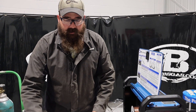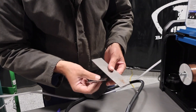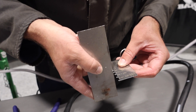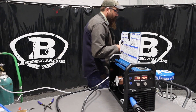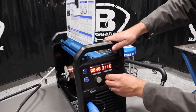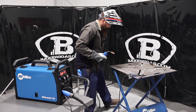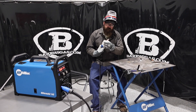Before welding I want to show you the material gauge. I've got a little piece of metal here — let's see what size it is. It doesn't fit in 14 gauge, so we're going to call it eighth inch. We'll set up our auto set to eighth inch on .030 wire and give it a try. So my setup is auto set, .030, eighth inch material. I've got my wire clipped, got my ground cable on — let's weld.